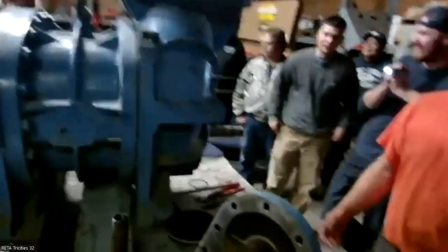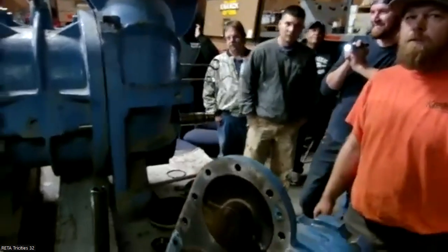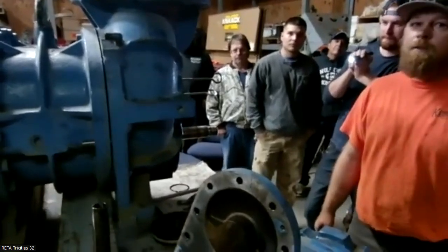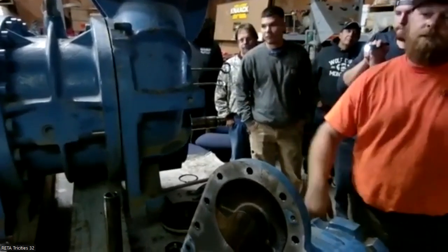So pay attention to those spurious oil pressure alarms you get, right? Yeah, it does make a big difference. You figure that machine's turning at 3,600 RPM, and it relies on that for cooling and lubrication, which are two of the things that make your bearings last longer. So all the bearings that we took out on the east side, are those all considered good main? Those are thrust bearings in this.